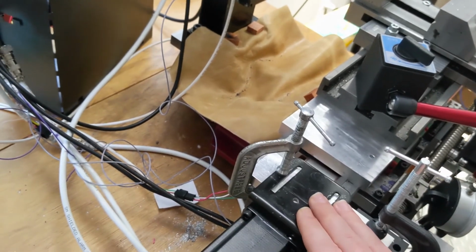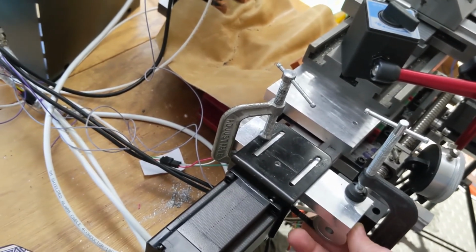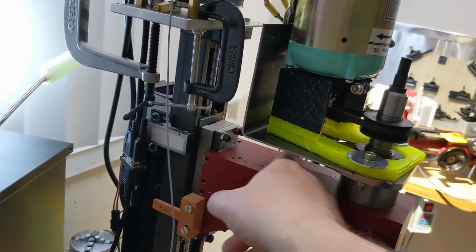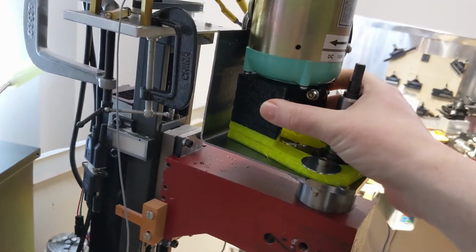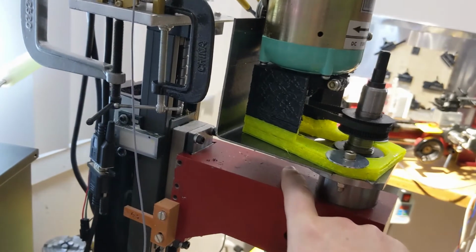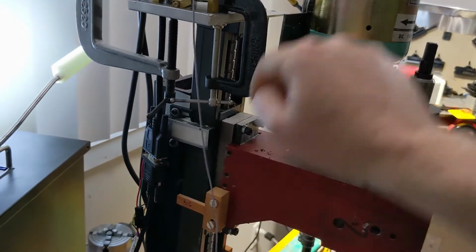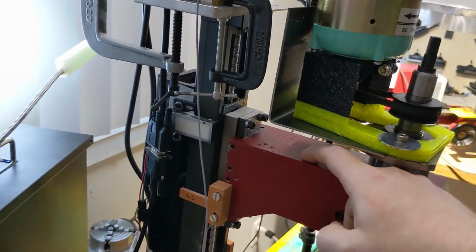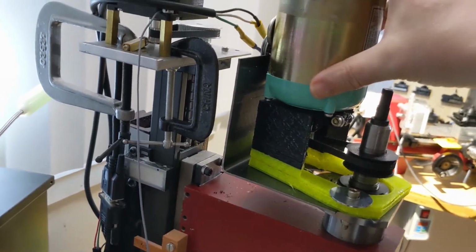Now I'm going to be focusing on finalizing the motor mounts. I've got some HTD 3mm pitch belts that I need to get installed. The super janky motor mount needs to be reworked, and I think what I'm going to do here is use aluminum extrusions. I want to be able to use different motors, and I want to be able to slide the motor mount back and forth this way. So I think I'm going to use an aluminum extrusion here, and I can create my return up that way, kind of an L bracket if I need to. But it'll be bolted directly down to here, and then I can adjust the motor tension, and then I can have different motor mounts, right?